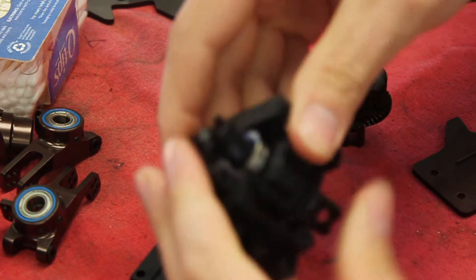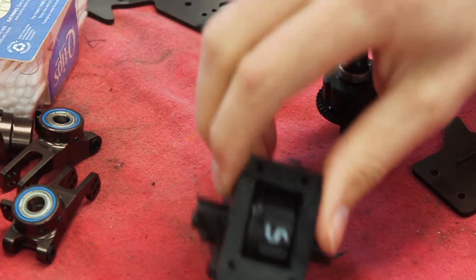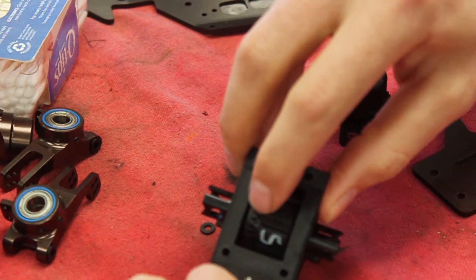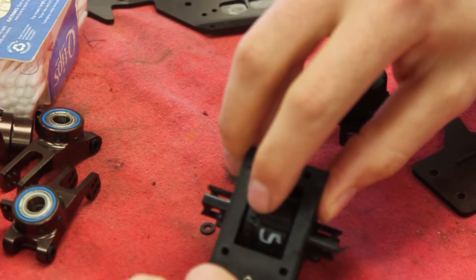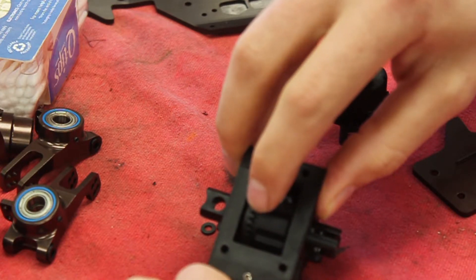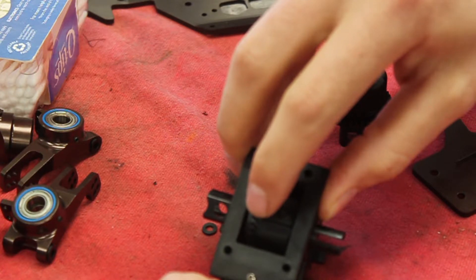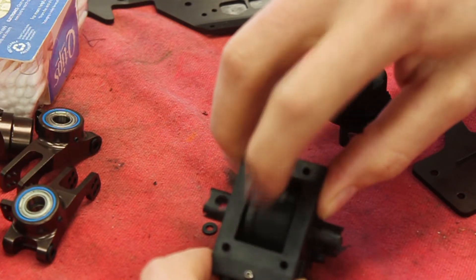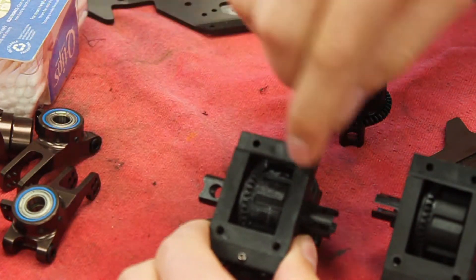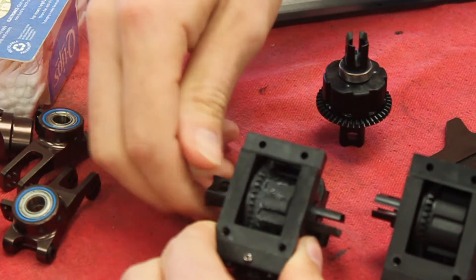To check the gear play on these, ideally put a couple bolts in. You hold the small gear and wiggle the big gear. This is the same thing for your gear mesh on anything else — you always want to hold the small gear. Because if you hold the big gear and rotate the small gear, the small gear rotates a lot even if it's touching. Just go to a couple spots. It was binding before without that one shim. But you can see there's a little bit of wiggle — that's what you want. Once you get some grease on there, not too much — I put too much on here, and if it sprays out all over it's kind of useless.